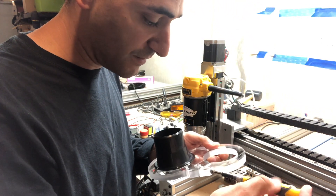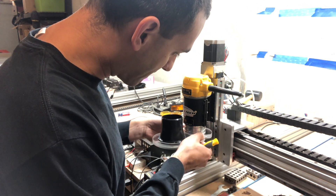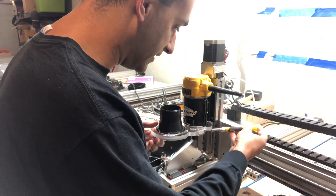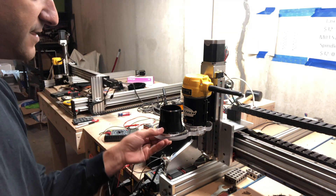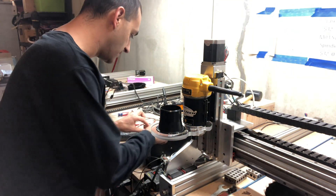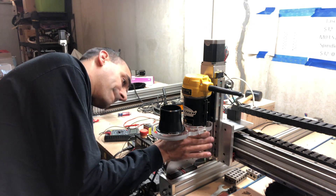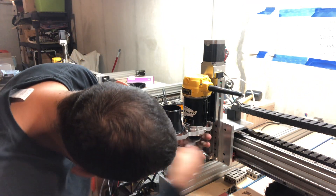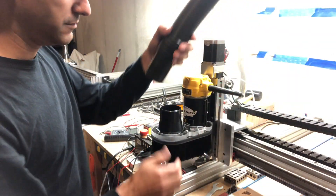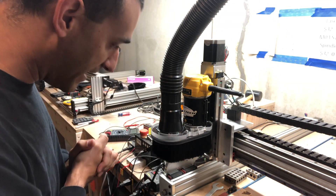It does not come with the key for this - I already had it out before the video started. So you've got to get an allen key, or I have a little screwdriver that already has that size. Open that up a little bit and just fit it up in there, nice and snug. Just a snug fit - look at that, it is not moving at all. And then you put your access to the button right there for your bit for the DeWalt 611. We'll put a bit on just for demonstration - we'll get out one of my quarter inch bits, tighten it down, and you have full access. Take this right underneath, snap it in place. Just like that - that's it. That is amazing, that is so easy compared to other shoes I've had.